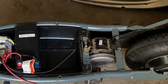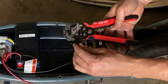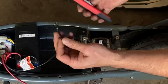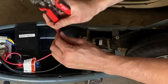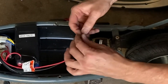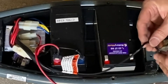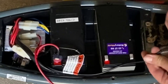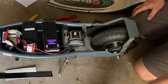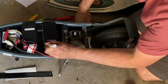Let's get that battery out. I've got my easy stripper here — if you don't have one of these, they really are brilliant. You literally just put the wire in and it strips off however much you want to take, really easily. Before we forget, let's push some heat shrink up both wires and push it up out of the way with plenty of distance. I'll put a bit of flux on those to hopefully make the solder contact a little bit better.